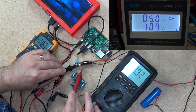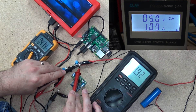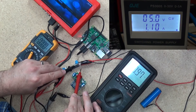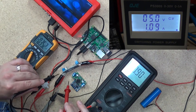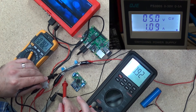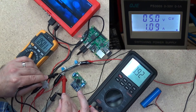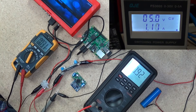This is the input of the regulator, and as you can see on the meter, that's actually 4.7475 volts — not a full 5 volts. But what about the output? The output of that voltage regulator is 5.00 or 5.01 volts — excellent. And as you can see, the screen and the Raspberry Pi are up and running with OpenELEC.